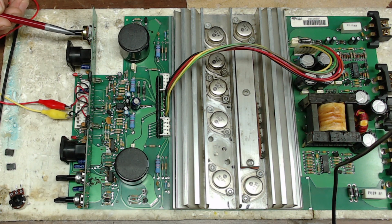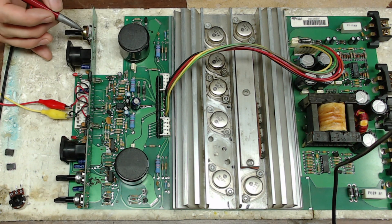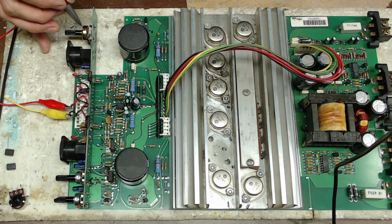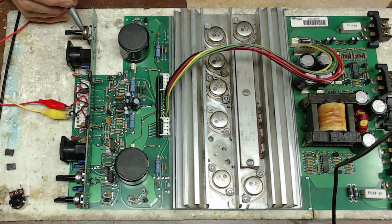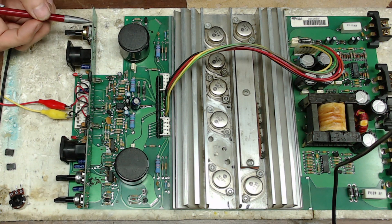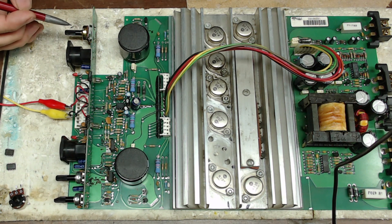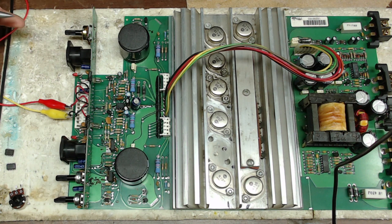This potentiometer right here was completely broken inside — almost destroyed. It took a couple of days to disassemble. I rebuilt piece by piece the plastic inside, the rotary part, and the wipers were completely broken off. The plastic retainer pins were sheared off and the center guide pin was broken off. I rebuilt this potentiometer fully and it's now solid and works as intended. If it were to take another direct hit on the front, it probably could not be rebuilt again, so I'd advise the owner to take real good care of it.